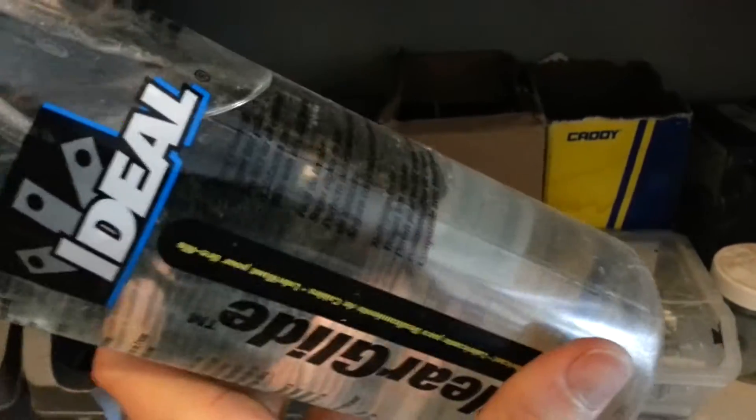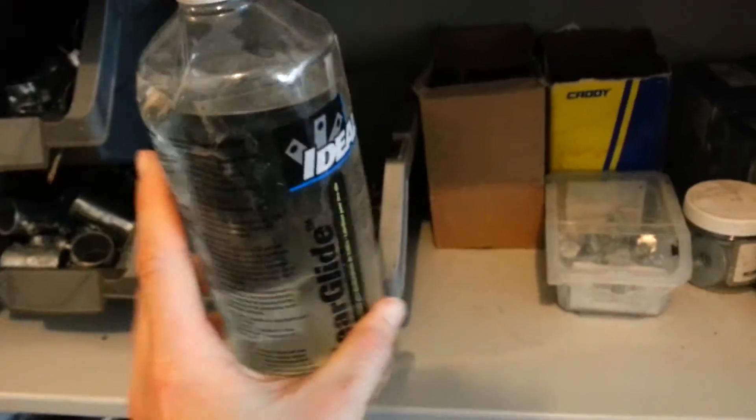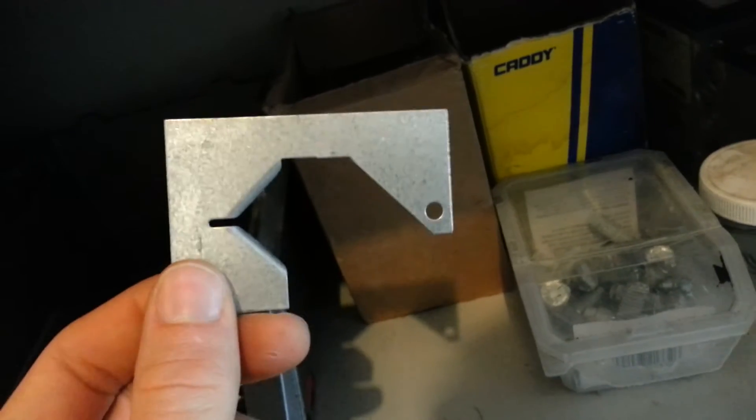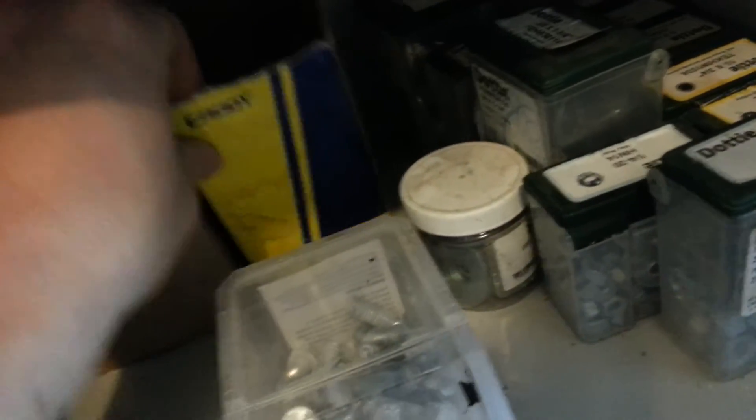This is what is known as soap — you put it on your wires before you run them through your conduits. Basically it's lubrication that makes the wire slide through the conduit easier. Must-have on big pulls. Here I have an anti-rattle MC strap — for if you have MC running along the walls, you put that down on the MC and strap it to the stud, use it tight so there's no rattling. Hence the name anti-rattle.